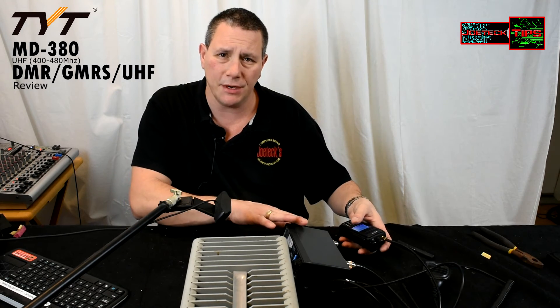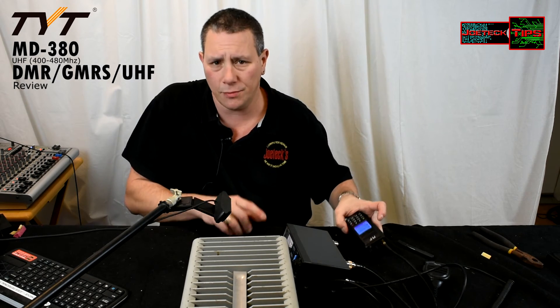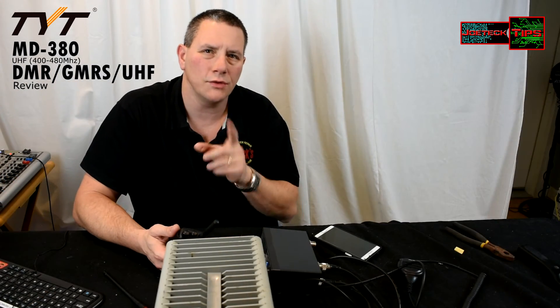It's a really nice radio. Considering it actually does about 4.2 watts output power with this meter — I'm not saying it's written in stone, it could be four and a half or closer to five — we get a good estimate based on the frequency range. The five-watt rating is probably at the middle of the UHF band. On the DMR side it's more of a two-watt radio, but in digital you don't really need a lot of wattage to travel.